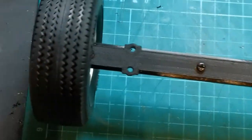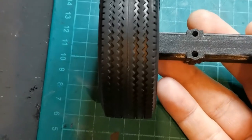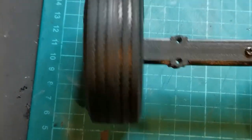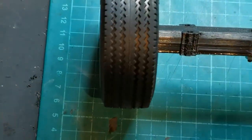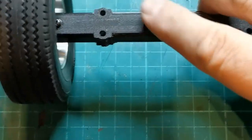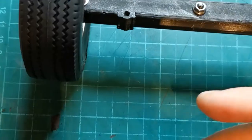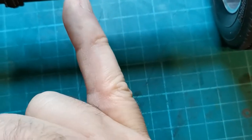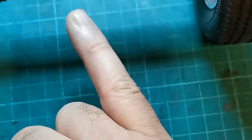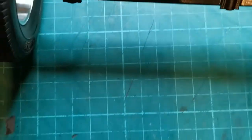If you'd like super single axles for the rear of your Tamiya trailer and you have the spare front kingpins, you can just bolt them into this 3D printed part. In low quality for mock-up it took about an hour and 20 minutes to print — fairly quick. I've designed it so it can be printed with this side to the bed for a slightly better finish. You could print it standing and get a better 7mm finish to the end, but the layer separation would then be horizontal rather than vertical. I'd recommend printing it this way and cleaning up the holes with a 7mm drill.